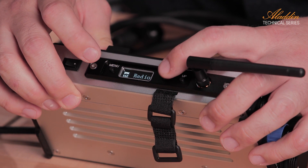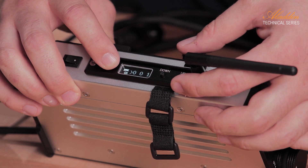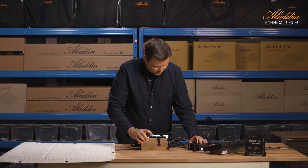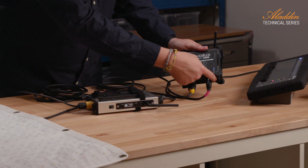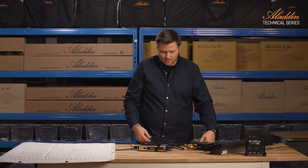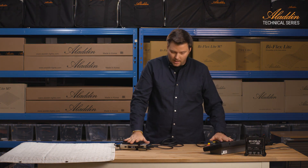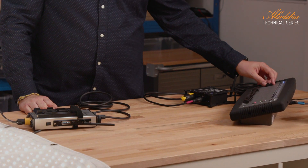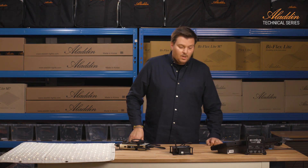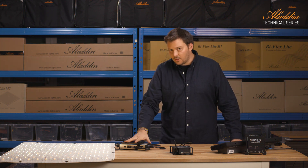Keep the address at 001 and go to Radio. Use the up and down buttons to change settings. The dimmer resets to the Lumen Radio settings. Go to Radio, select RF Link Reset and confirm Yes. Then press the connect button on the Exalux Connect and it takes a few seconds until they connect together. Once connected, you have a wireless connection between the transmitter and the dimmer via Lumen Radio. Channel one controls dimming and channel two controls bicolor.